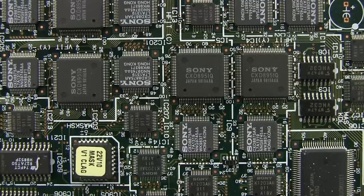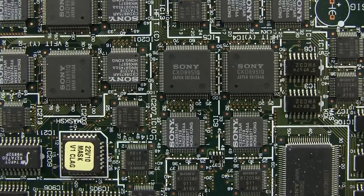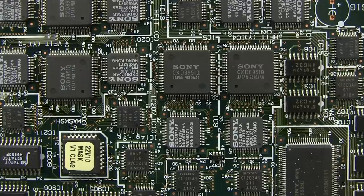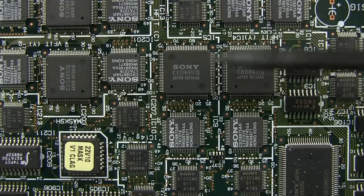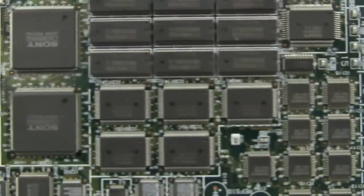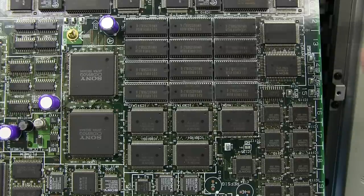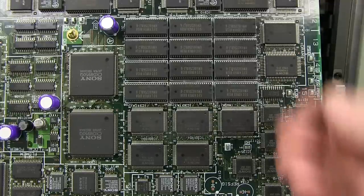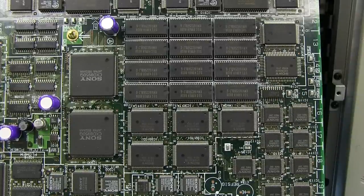But as I said, in professional layout tasks like this, I've laid out boards almost this big with pretty close to this number of chips, and with an auto-router you would not just place all the chips and then press the auto-route button and it does everything for you. As I said, you would selectively say, I want to route just this memory section here, please. I don't want to waste time messing around with this, just let it rip. So you would place them like this, highlight those and just let those rip and integrate all those in, something like that.